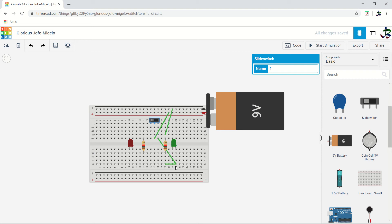What we did was: positive to terminal 2, terminal 2 to the anode of LED, and then directly to resistor. So the current is not going through the LED — it is bypassing the LED and going straight to ground. That wire is the mistake. This is how you find out the problem in your connection.